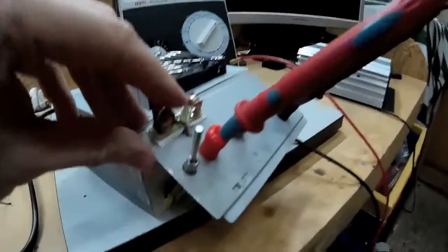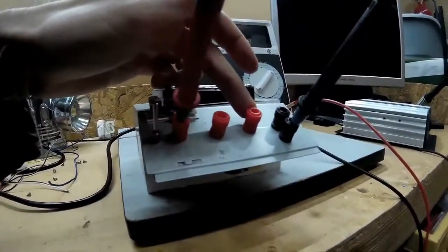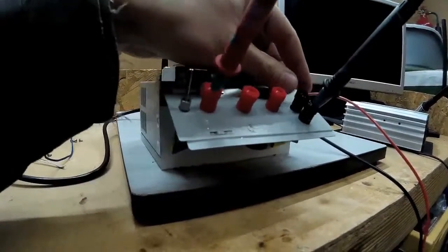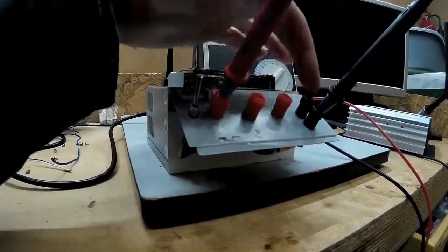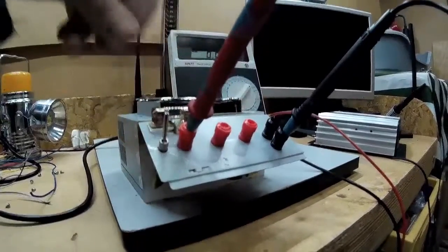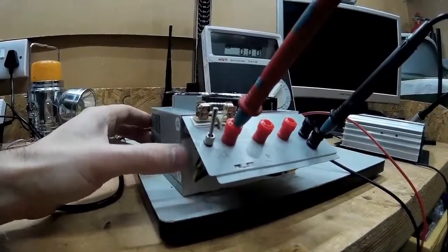I fitted the load up here and I've got a switch to turn it on and off. Then the 12 volt post, 5 volt, and 3.3 volt post. I used two negative ground posts. I didn't use all the wires because there's just not enough room, so I used four wires on each of the black, six on the 3.3, six on the five, and six on the 12. I cut about two wires out of each rail, so there should still be enough wire to hopefully get up to about 18 amps.